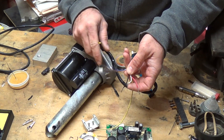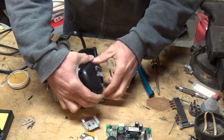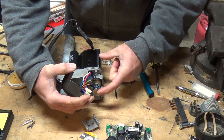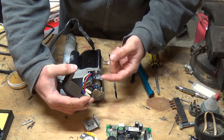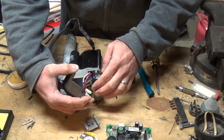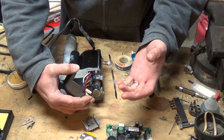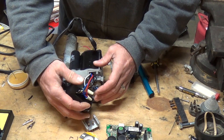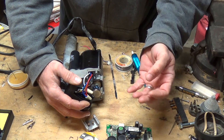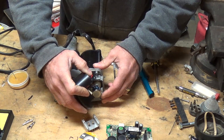Here are the control wires — let me show you. When we take off the bottom cover, I can see the control wires which are blue, orange, and brown. They go to this potentiometer, which is connected to the gearing. As the motor turns, it will turn the potentiometer, changing the resistance in those wires. You can read that on the Arduino — you can see a reading on it. You can use that reading so that when it gets so high or so low you can turn off the motor, keeping it from bottoming out or topping out and causing damage.